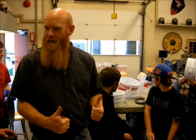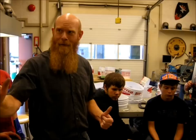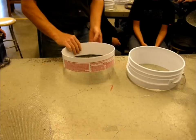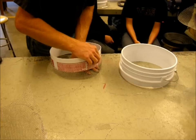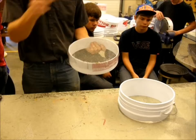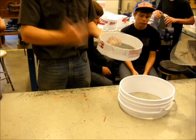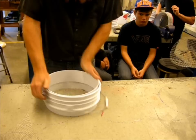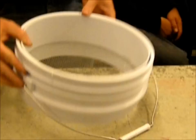You guys have now spent time making sure the wire's in the bottom perfectly. So the next step sounds funny — you just spent ten minutes getting that in there, now let's take it out. But it is now the right size and shape. If you take it out, you can take that next plastic piece and carefully — I say carefully because there are a lot of sharp pokey edges — carefully work it inside all the way around. Push it down nicely. Your wire will go over the outside of that piece. Take it out to do this — don't try to do it inside the bucket, you'll have nothing but a nightmare. Put the plastic piece inside like that, and now it should be easy to push that back in.